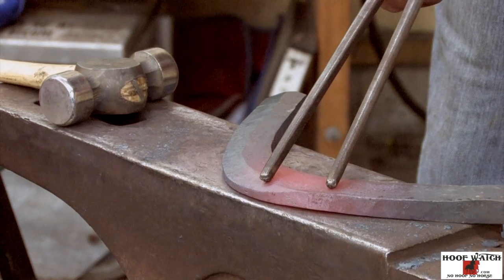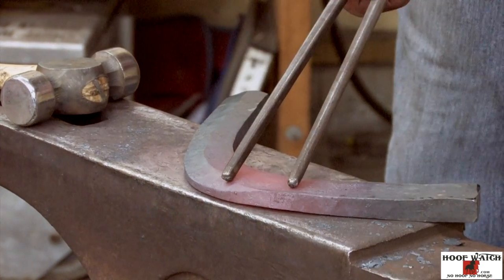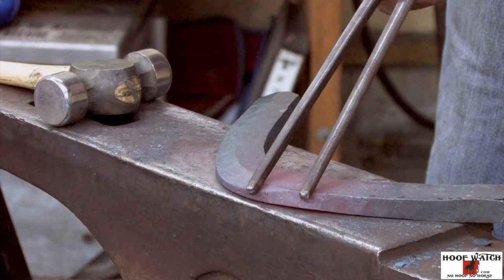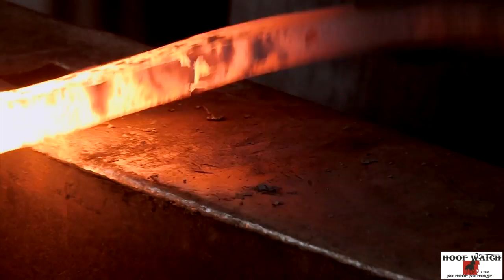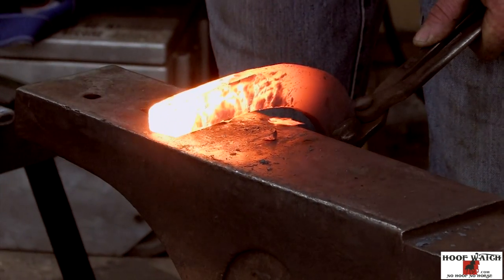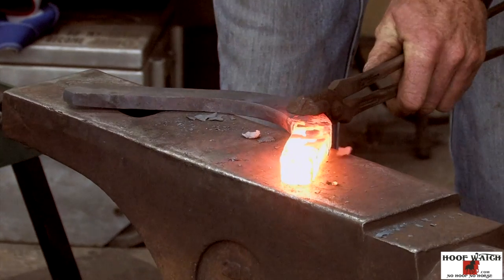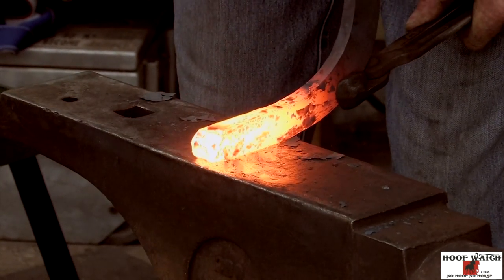From your toe clip to your beginning of your fuller end, you don't want to be penciling this up because you're gonna end up hemming and then it'll make your toe look weak right in this area here. You always fit a wedge like you would fit a wedge pad. You're not gonna fit penny on a penny because that'll be so short, it's not even funny. So you wanna have enough width on your heel to fit with a little bit of length.